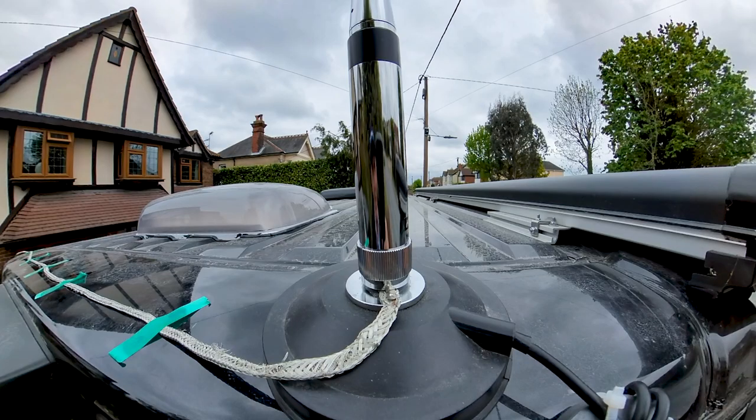This is only a temporary attempt — I'll make it more permanent, though I'm not quite sure exactly how yet. The point is that it does increase the capacity of the mag mount significantly. I don't know the exact increase in capacity, but it's probably around 30 or 40 picofarads, maybe more. It certainly enables the mag mount to now be used on the 20 meter band. I haven't tried 40 meters yet because I probably need some more braiding.